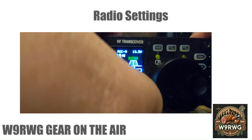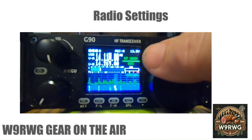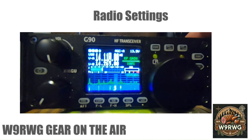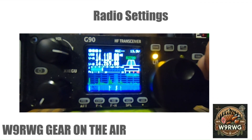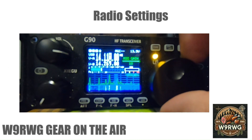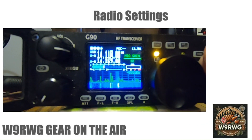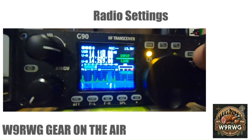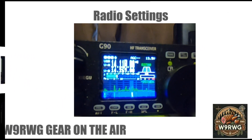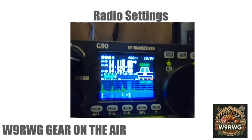Long press the AGC-SPL button to access the RF gain. Adjust the RF gain to 100% by spinning the big VFO knob. Press the FUNC button, then press the POW button — that will display the microphone gain. Adjust the gain to level 10. Then press the POW button again and change the radio from microphone to line. Next, use the mode buttons on the top of the radio to toggle the radio into USB.